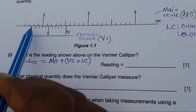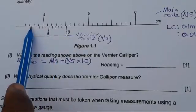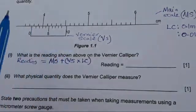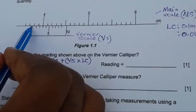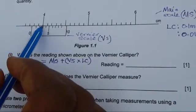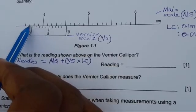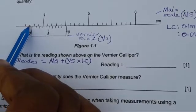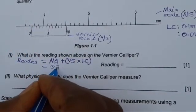Take note of where the vernier scale is. The point where it starts tells you that you are not supposed to go over this scale. Our main scale reading will be the mark just before where the vernier scale begins — not the one after this scale. So if this is 4, going back gives us 3.9, 3.8, and this one is 3.7. So the main scale reading is 3.7. We are going to replace that as 3.7 plus.